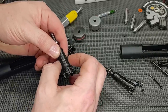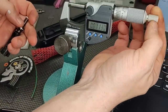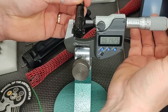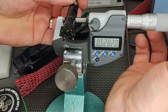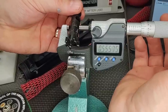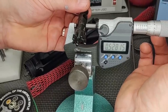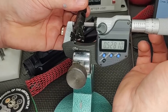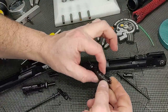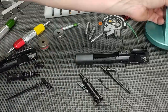Let's move to measuring the support ring. I'm going to make sure this is zeroed out — and we're zeroed. The number we'd like to see is .528. We have .5281 — that's actually pretty good. This ring has nothing to do with gassing; it controls how much slop there is when it's inside the carrier. This dimension along with the first opening in the carrier determines how much play there is. Both are reading about .528, which is pretty good.